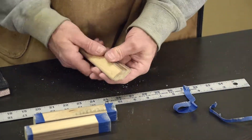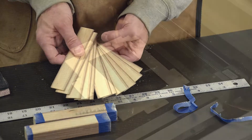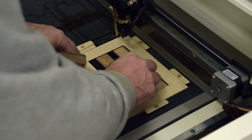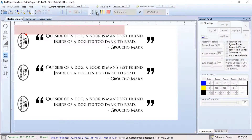With the nicely contrasting wood you could just add a finish at this point and be done with the bookmarks, but that would waste a perfectly good laser. Using a simple fixture that I cut using the laser, I can gang together three bookmark blanks increasing my throughput. Engraving on the laser is done in two steps. First, a raster operation burns the graphics at 500 dpi — it works similar to the way an inkjet printer prints, except with a really powerful light.